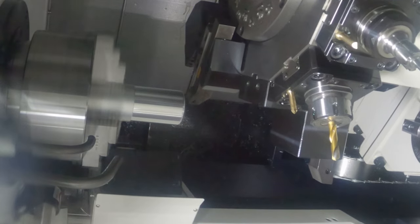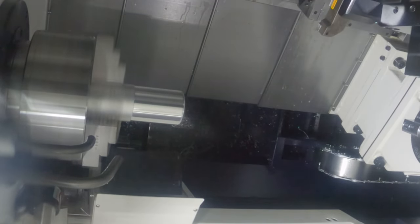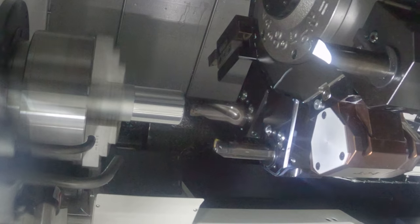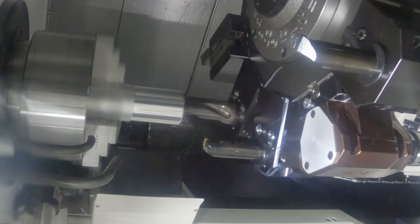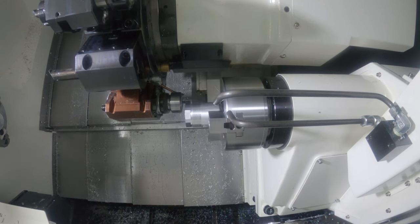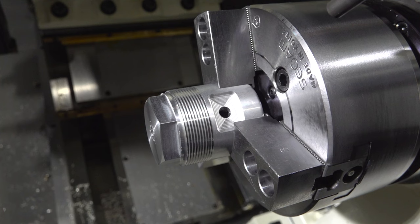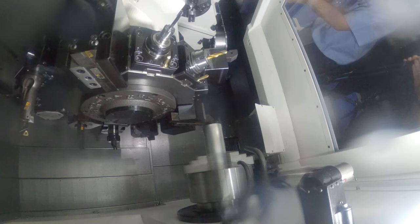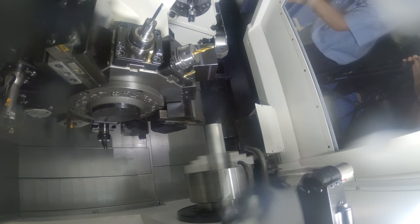It's a really good man for all seasons — every material, every diameter size, it'll really give a lot of ability to the customer. But it's not just a standard chucking lathe either — there is a sub spindle on this variant as well. It's so important that you've got so many different tools when you might be doing totally different operations on the back side of parts. We've got the sub spindle as one option, or we can have a tailstock. We've also got a built-in ejector, which is very, very simple — no cylinders, literally very simple to use. Built-in parts catcher can be equipped to a parts conveyor. So it's really a very flexible machine tool design and package.